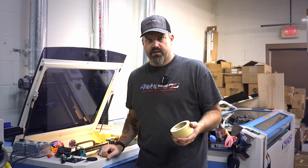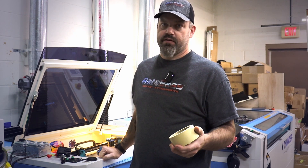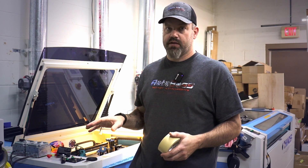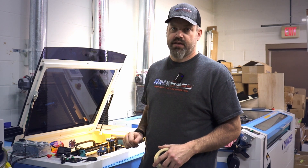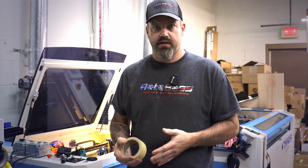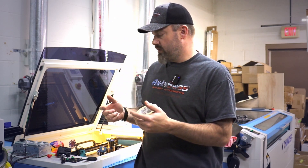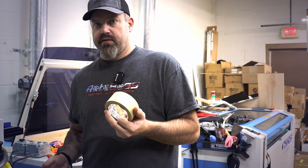This will help with aligning plaques, your rotary, and all kinds of different stuff quickly and easily on your bed. You can also do this where if you're doing multiple pieces and you have a layout, you can actually create a removable layout on the bed. But really it's best to make a jig of acrylic or a thinner plywood that you can quickly put in and take out. If you don't have money for that, you can use the tape method to accurately line up your stuff.